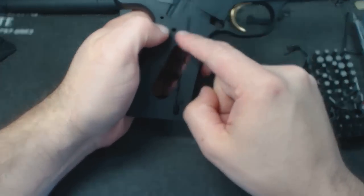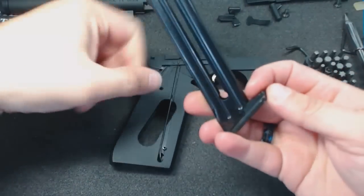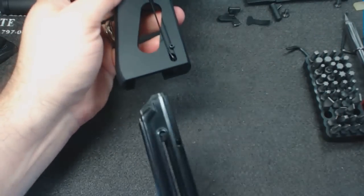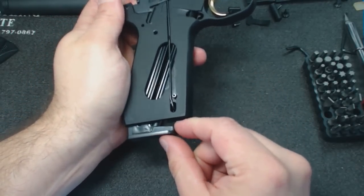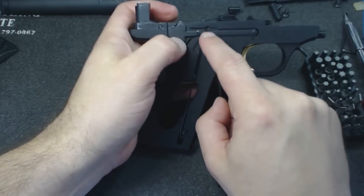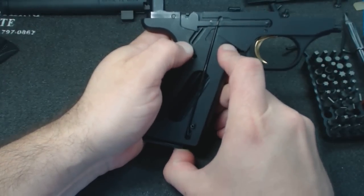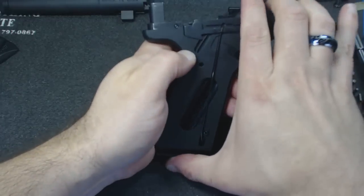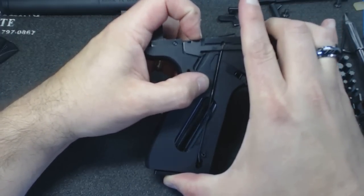And this long bar is the magazine safety. Again, I complained about this in the last magazine safety. Rather than something at the magazine top triggering it when the magazine is fully seated, it did it the other way around. It's the bottom that determines that the magazine is seated. So it's just this foot that ends up pushing in on this little lump right here, which is attached to that metal bar. If you notice, the trigger bar is being pulled down when that magazine goes in, and this bump gets pushed up, this whole bar is going to come up, and that's going to let the trigger bar lift up into the operating position. When the trigger bar is down, that's the disconnected position. When it's up, it's going to be engaging the sear, which we'll get to. It's actually right there. And the disconnect stroke just pushes it down.